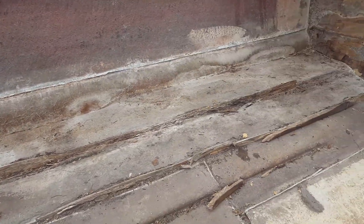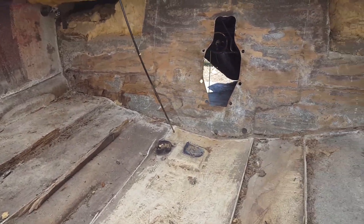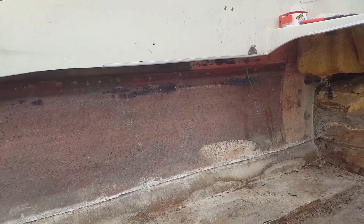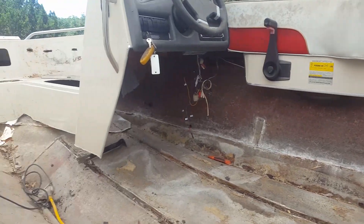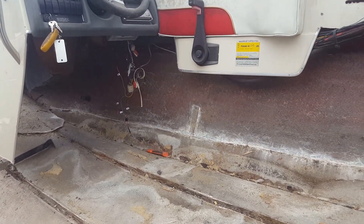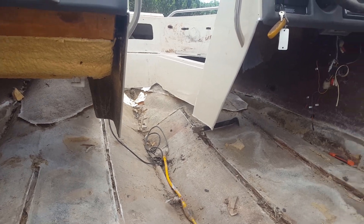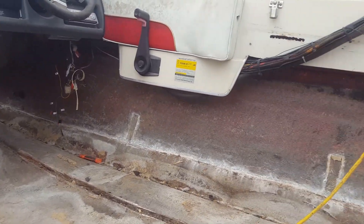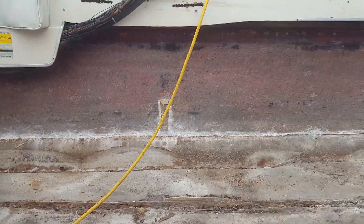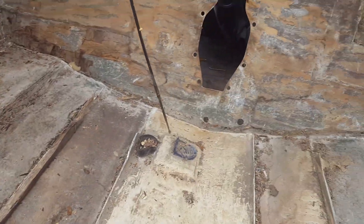The grinding phase I've saved to the very end — even for the transom — because when you start grinding it will cover every absolute piece of this boat with really fine fiberglass. It's probably the most annoying part, because afterwards if you want to come back into the boat without your suit on, you're going to have to spray the boat down. So I'm going to get absolutely everything I can out of here, grind off all the little edges, and when you start grinding you'll need a hose ready to spray everything down.